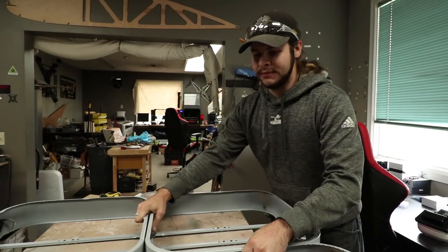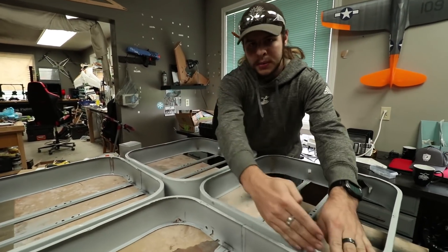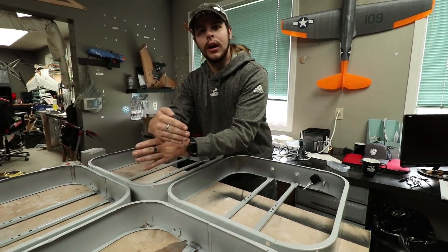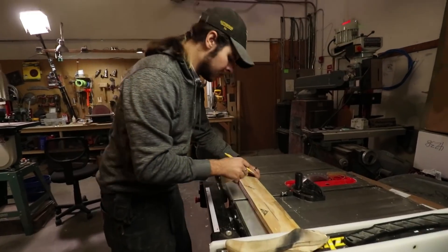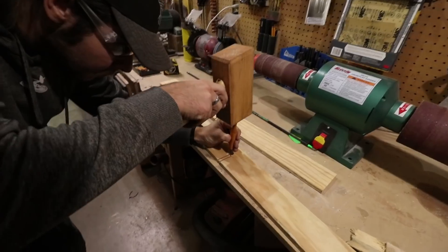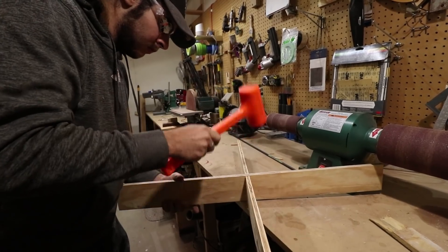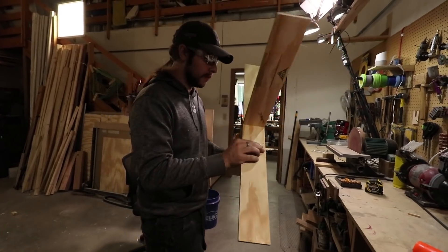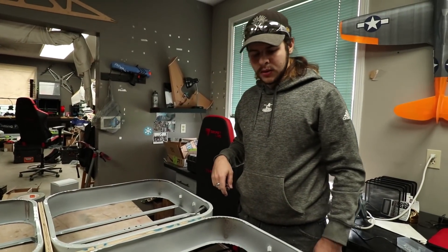The fans are taken apart. We're probably gonna put these frames together like so. Let's go in here and see if Chad can give me a hand. If I just bolt this together it's gonna wobble and shake and it's not gonna work. So we need it to be as rigid as possible but still try to keep it on the light side. We're gonna spread these apart and put a piece of wood. I'll cut both of them and get them to go like this. Instead of trusting my math, I'll just trust my eyeballs. Gonna get some bolts and screws and screw it together, and then we can move on to the motor mounts.